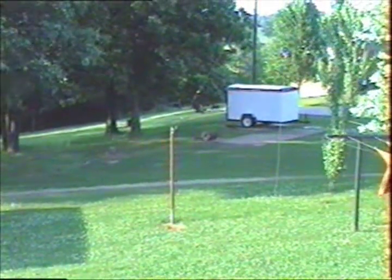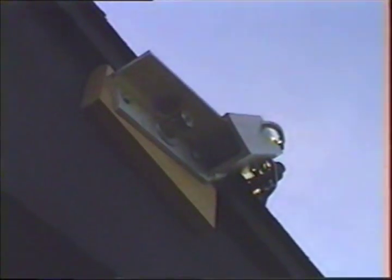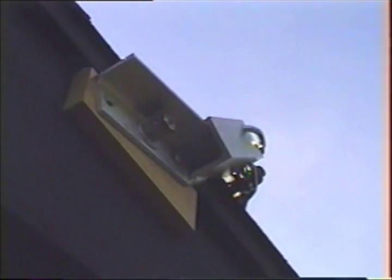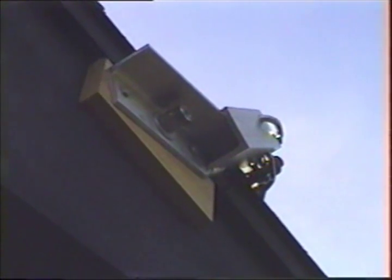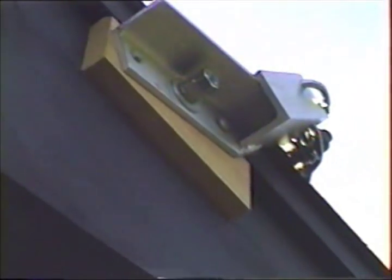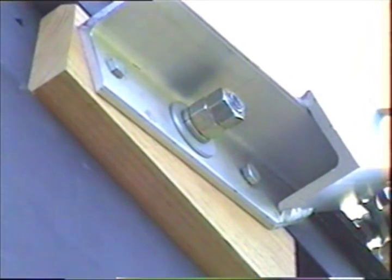The three guy wires — one goes out to that pole and the other one runs over to the house. My anchor supports on the end of the house are angle iron aluminum, and the guys at work helped me acquire these and weld them in place. I've got turnbuckles directly on top of the roof. You see the bolt there, the two nuts — that is what's actually the main anchoring system. I've got two other lag screws on left and right, but that's the configuration, and I'll show you how it's tied into the roof system.